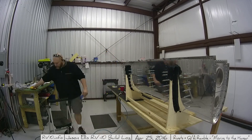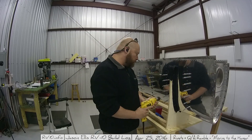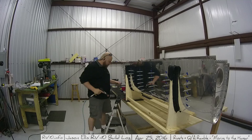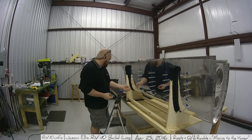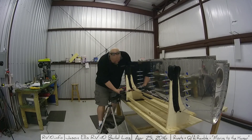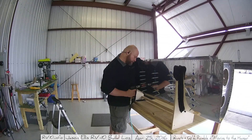For the last part of this, I'm going to go through and start adding rivets and put a little bit of blue painter's tape over that and do the deed. Someone told me it looks like I'm dipping when you see me pick up the red Solo cup and spit — I'm not. I'm chewing sunflower seeds, which may be just as nasty a habit, but you've got to spit out the shells. You can see I'm going every other rivet, and occasionally I'm match drilling a little bit because every once in a while the rib and the skin still don't quite allow me to put the rivet in. Even though I don't have to clean that hole up, I go ahead and do so. Nine times out of ten it goes through completely perfectly.